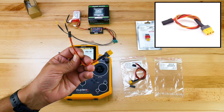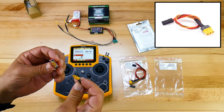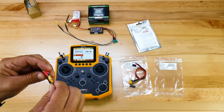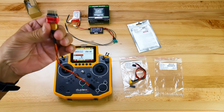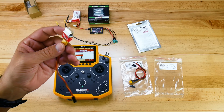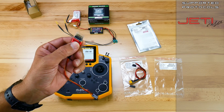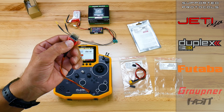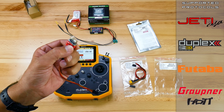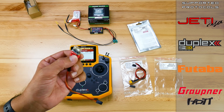For today this is what I'm going to be using to demonstrate how the device works. It's very simple: you take the device and the cable you have selected — it is polarized so you can't plug it in the wrong way — and go ahead and plug that cable in. It makes a very nice, neat, small package. It does have six outputs, so you have the ability to break out either six servos, or in the case of telemetry, five servos and set that sixth port up for EX telemetry.